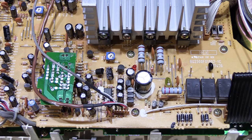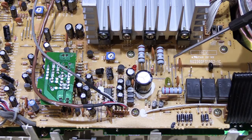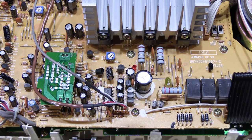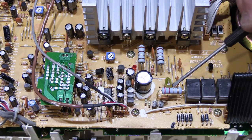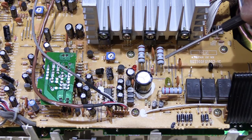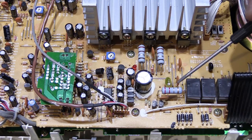I'm going to show you what happens when you pass too much current through a resistor not designed to handle it. Ed's set has a shorted amplifier. One of the ways I know that is these two resistors look somewhat different from the third one. All three should be the same type with the same rating — red-red-gold-gold or red-red-red-gold — but these look more like brown-brown-silver-brown or perhaps black. When I saw this I knew right away that they had begun to overheat, and the overheating changes the color of the banding because they get so hot.